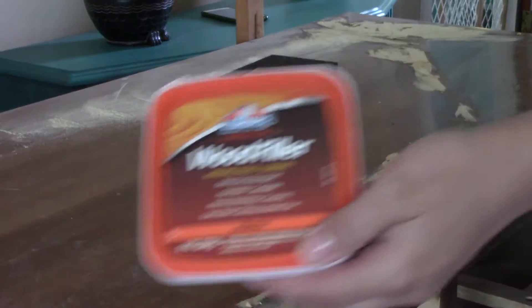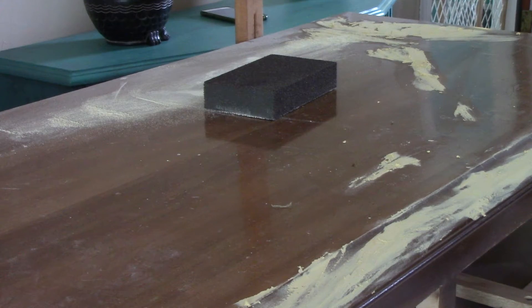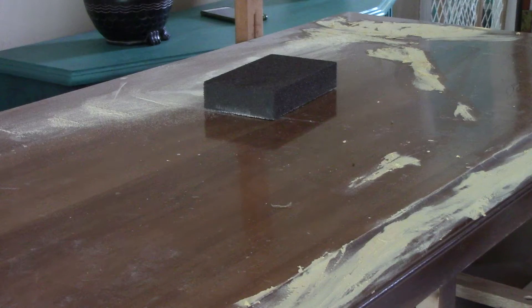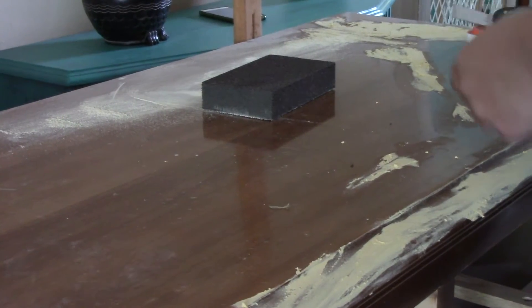The first thing I did was get some Elmer's wood filler and I filled in the areas where there were scrapes and scratches. This is at least a 40-year-old piece of furniture that arrived to me with a bunch of scrapes and scratches, and also scratches on the rim. I used the Elmer's wood filler and I really liked it because it dries fast. It's paintable and sandable, so you can get a nice smooth finish. When I was finished, you could not tell where the big gouges were. I applied this with a putty knife, which is how you're supposed to do it.